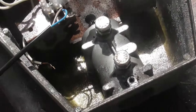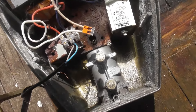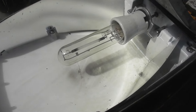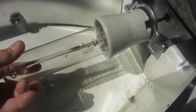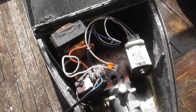This OptiSpan lamp didn't have a ballast — somehow it went straight from the connector to the igniter. It may have had a pre-ballasted lamp, one of these mixed dual lamps. I'm going to put in what I think is a 150-watt lamp. These ballasts are about 75 or 80 VA, so I'm going to try one and connect it up and see what happens.